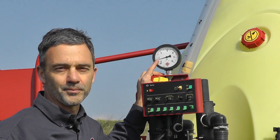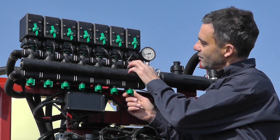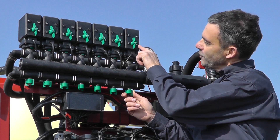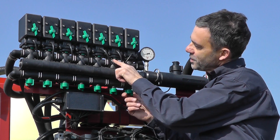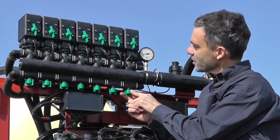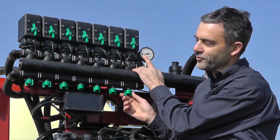Let's go and have a look at this regulation. Right, we're at the control unit now. You can see from this little indicator that the valve is off. The other ones are all on — you can see the green indicator pointing down. So this is the one I adjust, and the pressure should be 2 bar. That's what the pressure is at the front.